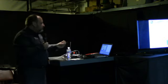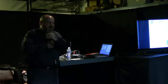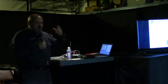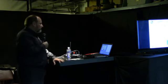So the DV dongle is basically a little tiny box with a USB connection on one side, and that's it. Its sole job is to convert the data stream coming over the wire, in this case because it's hooked up over the internet. So it's getting the digital audio stream that's in DSTAR format and converting that to audio that your PC can play for you. So you can plug in headphones or listen to the speaker, and it'll convert DSTAR audio. So much like Echolink can do kind of natively, this lets you plug into the worldwide network and participate without any other infrastructure, with only an internet connection.